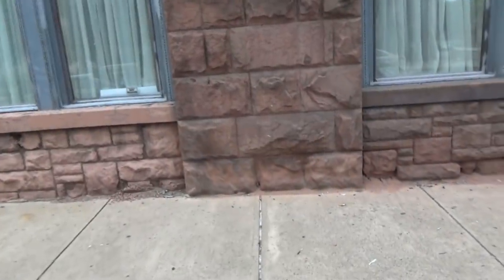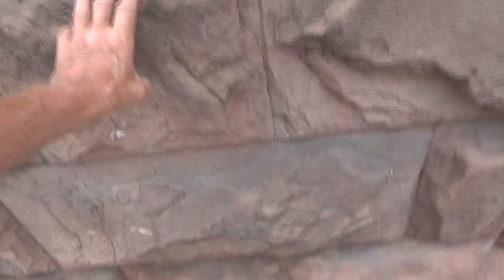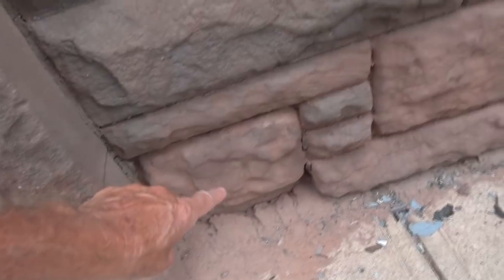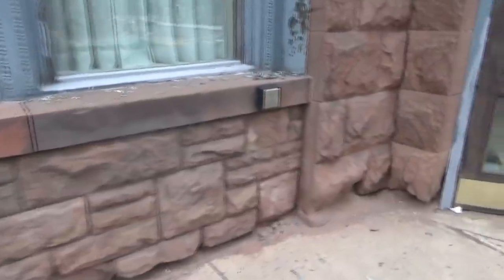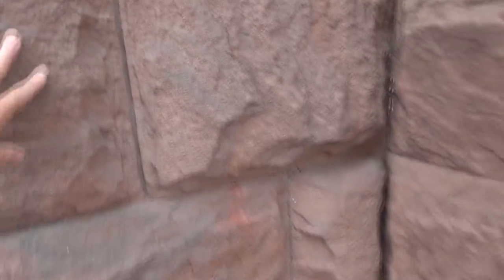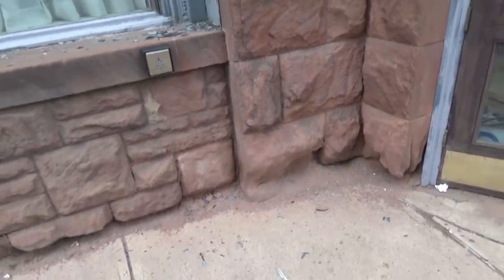Now in my area of the country, what happens if you don't use a water table? You can actually see the stone is deteriorating — it's turning into sand. It just deteriorates. That's why they use a water table when it comes to stone. Brick is a hundred times worse. Look how much it wore away here. The stone up here is good where the weather isn't getting to it, but when the water splashes, it goes against the stone — that's what happens.